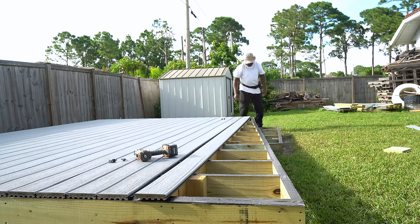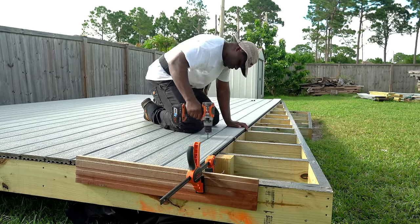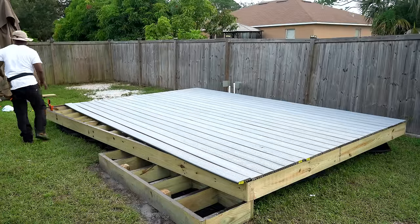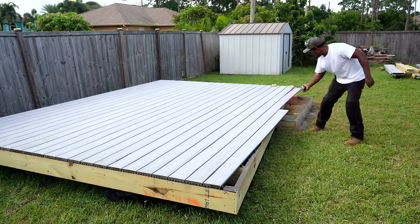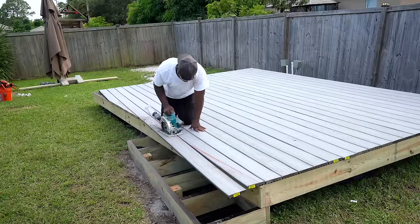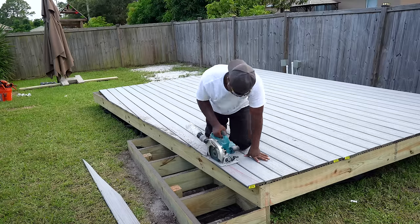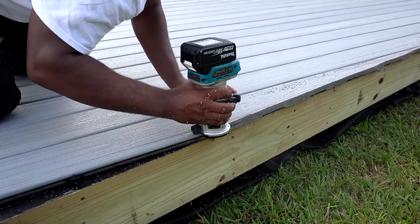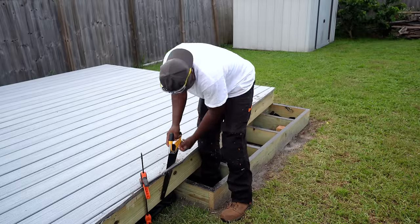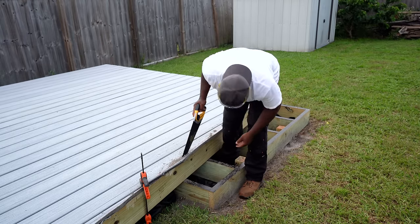As I approached the angled section, I handled it the same way as the rest of the deck — just continued working toward it, and wherever the board hangs off is where it gets cut. With the majority of the angled piece attached, I drew a chalk line and cut outside the line to play it safe, knowing I could always sand it down to the face board. I tried a jigsaw at first and that worked okay, but a circular saw worked out much better. With the deck boards trimmed, I tried a router but it got difficult having to keep applying and removing the clamp. So I switched to a handsaw, which I felt more comfortable with and gave me more control.